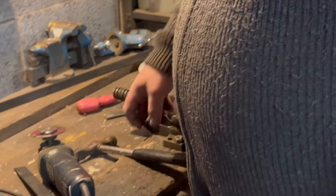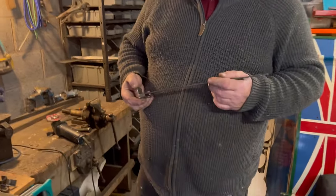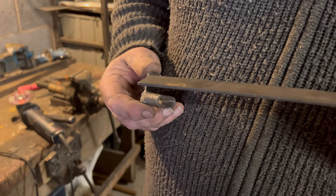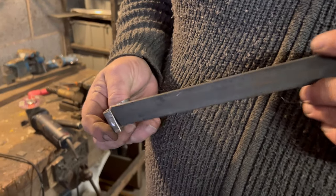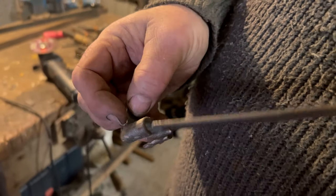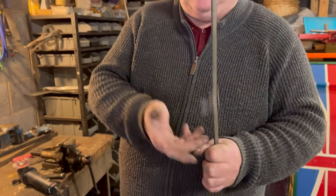What I've done is basically a bit of fettling — I think that's what it's called in metalwork, where you play about with it and refine it. I've just been round with the grinder and ground the edges off a little bit. I got the grinder blade in there and there, but you can use a flat file to do exactly the same. It just gives it a bit of play on it — it's got to be loose. And then, hickory dickory dock, the mouse runs up the clock — like that.